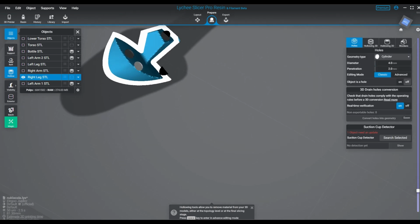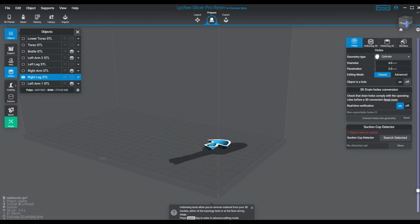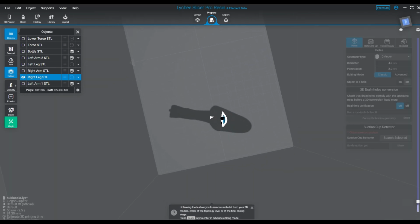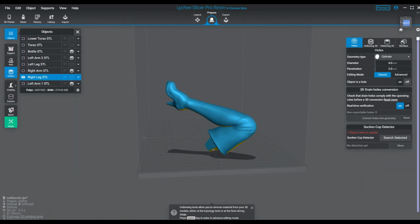It also needs an additional hole in the side of the key, because that's going to actually hit the bottom before the actual tip of the key does, where the hole is, and I think that that's going to be necessary to prevent extra suction in that part of the print. So this should actually give you a much cleaner pull off in the beginning and prevent those extra suction forces happening due to suction cups.